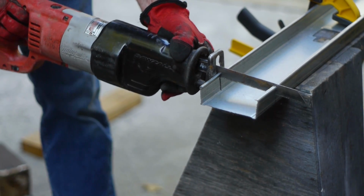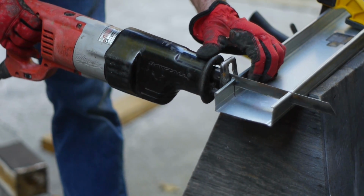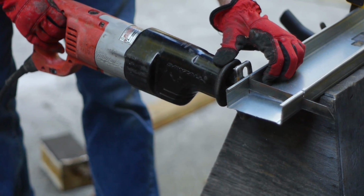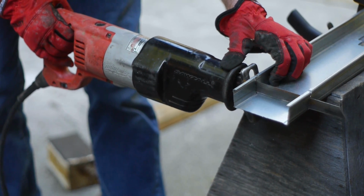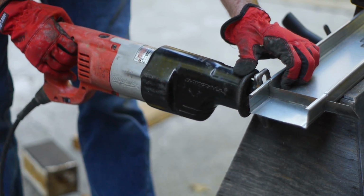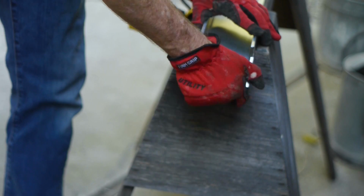Another way to cut just one stud is to cut the 2 sides of the stud starting at the open end. You will need a longer blade for this. Once the 2 sides are cut, score the surface of the stud so you can bend and break it off.